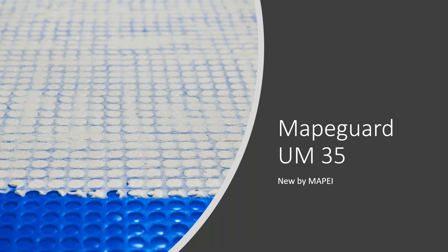How would you waterproof around the edges of walls? You would use the MAPEGUARD WPST seam tape — apply mortar around the walls, take your seam tape, fold it in half, tuck it into the wall with at least two inches up the wall and two inches on the floor, press it into the wet mortar, then apply mortar on top of the seam tape. Make sure you use corners and do the same thing with the corners. That's how you waterproof the edges of walls. Yes — it's the sealing tape that makes it a waterproof system.